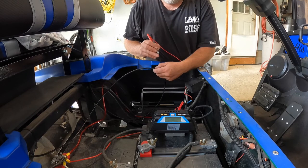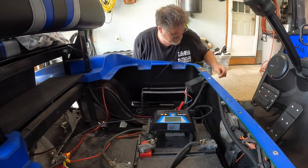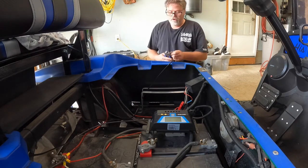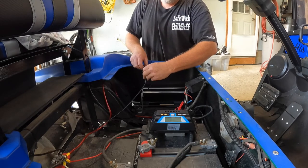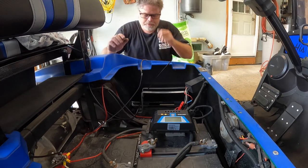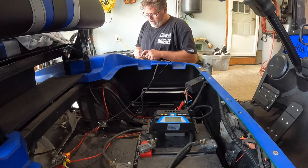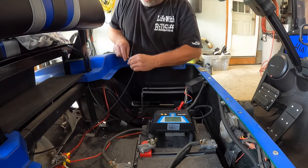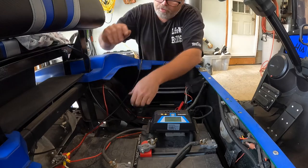Okay, positive and negative identified. We're going to need a piece of that black wire because it's not long enough - why would it be? We'll twist these together, then get out the solder and solder that. Take a piece of heat shrink and slide it all the way down and stick it over that joint so we make sure it's a nice clean connection. Look at that - it lengthened that wire.